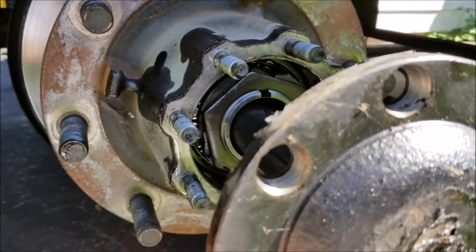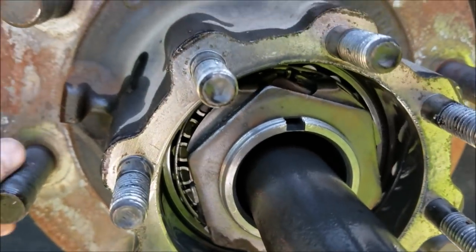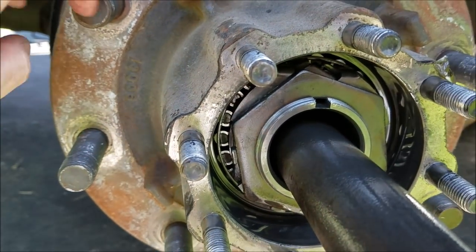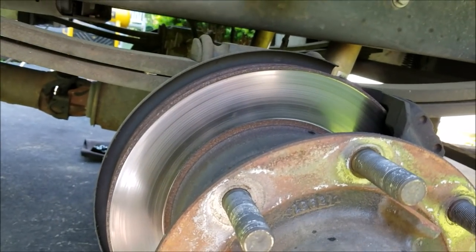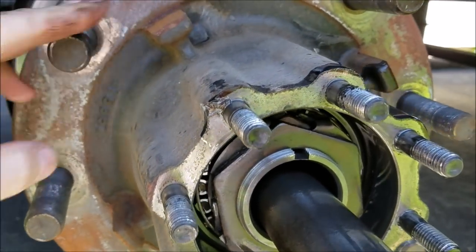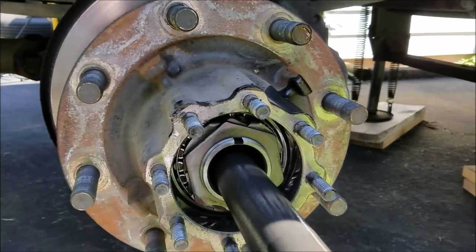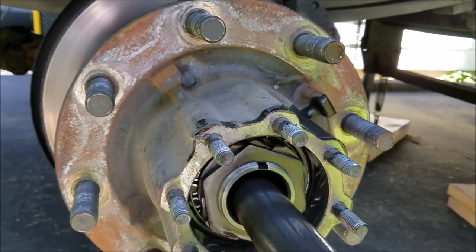Here's the axle of a W24 — that great big bearing in there, a large nut, and a little locking tab I'll have to bend back to get the nut loose. I can't remember if I've said this before, but before I took the axle loose, I took a punch and made a mark on the axle and the hub so I know it goes back in the same spot. I'll slide this out and start taking some more stuff apart.